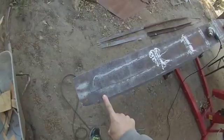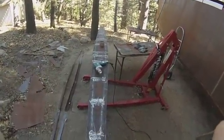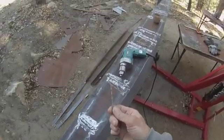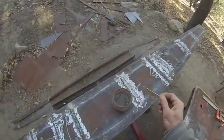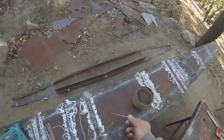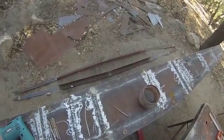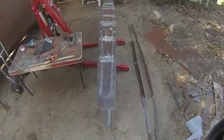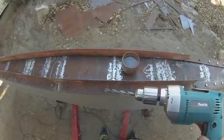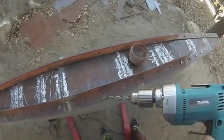Got all the pilot holes drilled in the top of the keel where it's going to be bolted on. They are 100 millimeters apart. This is the drill bit I used — what's cool about it is that it lasted this whole time. Part of how I kept it cool enough to maintain its edge is to dip it in water between about three times for each hole. This is 11 gauge mild steel, which is supposed to be about 1/8th of an inch but it's actually a little bit less. There are a total of 66 holes. As the sizes go up it's more and more difficult to drill the next hole, so I rotate the bit around inside the hole once it's drilled to make the next step up a little bit easier.